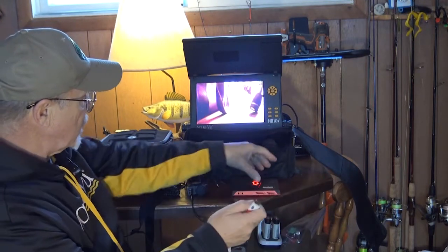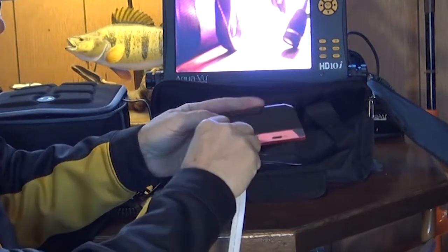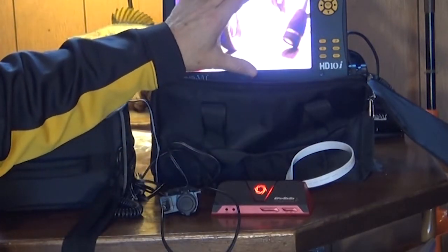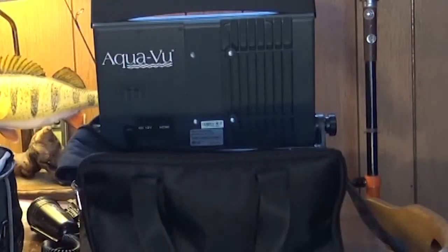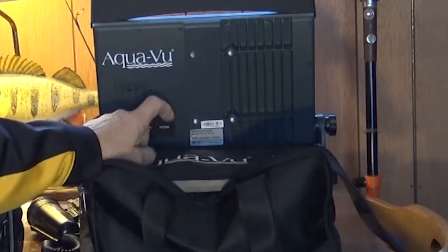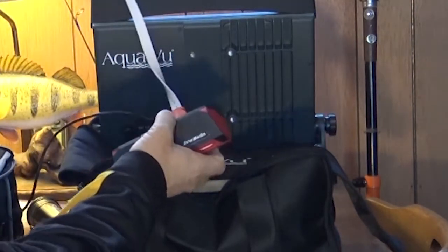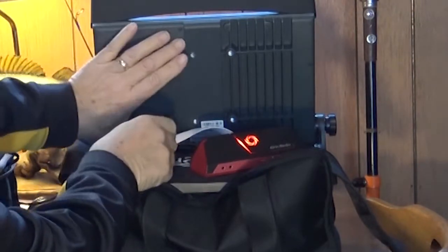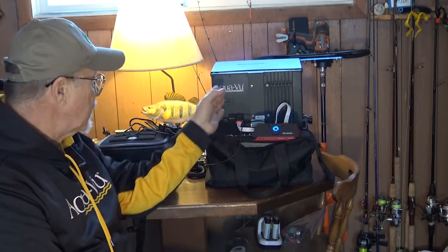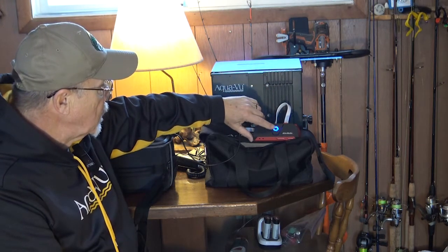What you're going to need to do is plug that into the HDMI in on the back of the Avermedia. Turn the unit around — now you're going to need to plug it into the HDMI out on the back of the AquaView. The HDMI out port is protected by a loop plug, so pull that plug to expose the port. Take the Avermedia unit and set it on the back of the AquaView — that's why the flexible cord is nice. The HDMI is plugged into the HDMI out on the back of the AquaView, and plugged into the HDMI in on the Avermedia recording unit. It goes from red to blue and it's ready to record.